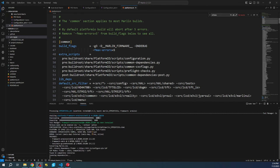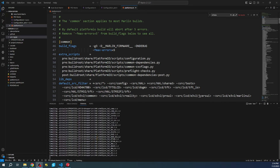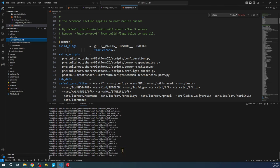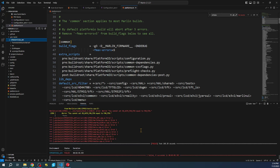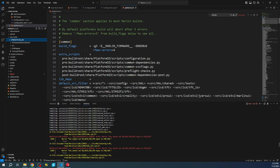The moment I clicked pause it started to actually build. As you can see it's building and starting to populate inside the .pio folder. We may see some yellow warnings, but we're actually seeing red. Looking at the error, it says: 'Sanity check: you cannot use E0 for your fan pin.' So there's a safety precaution we have to deal with.